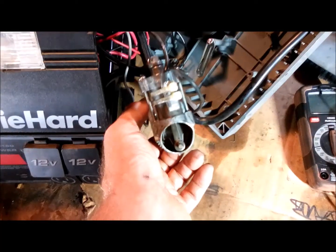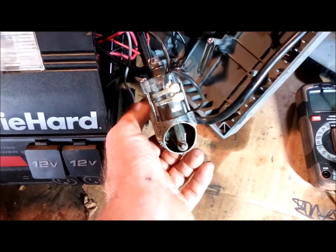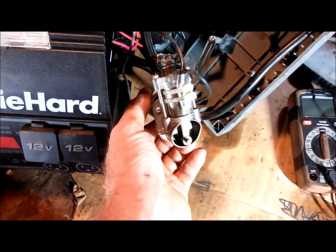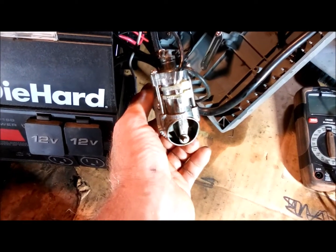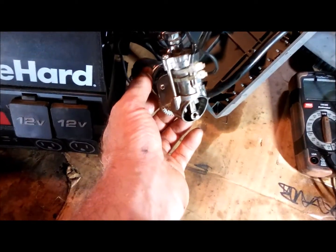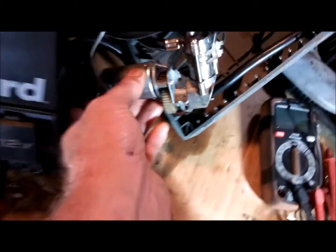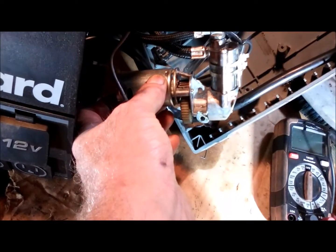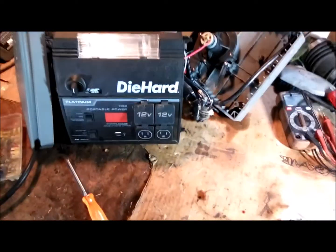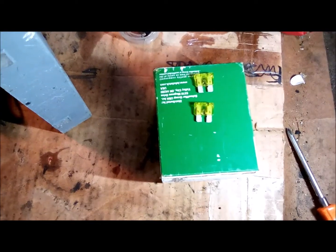The way I charge it now is I use my 12-volt car charger, hook it up to the jumper cables, put the unit in jumper mode, and charge it through that. But that's a pain — it's supposed to just plug in. I've got to figure out where the charger circuit problem is. I'm going to Loctite the pin and put it back together. The compressor is all back together now; I'm going to let it sit overnight and let the Loctite dry. I'll probably put a little lithium-based grease on the gear.